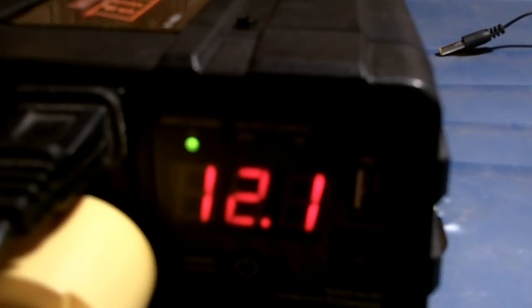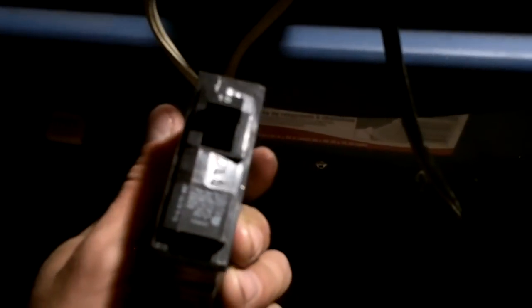That will show you how I did it. It's a nice bright garage but it's really pulling a load off my batteries. Under this load it's holding at 12.1, so that's fine. I connect it to this heavy duty fridge cable. I put an inline breaker — I don't think that's really going to do much, because I don't think this inverter can ever have enough power to trip it. But just say I accidentally turned the power on in the house and it back fed into my inverter — which I am extremely careful about — I'm hoping that this would flip first, either this one or the one inside the house, before starting any fires or anything like that.